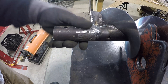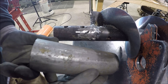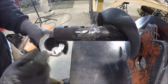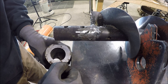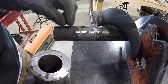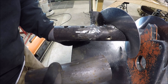I've got that paddle ground off and ground a lot of the little welds and boogers, just trying to get this thing back to halfway round. It's still a little oblong because it's been stretched. I did find this nice hunk of mystery steel — the bore is perfect. If it were one and a half inch in diameter it would fit just right, but since it's flared out it won't go on. We can bore this out to a nice slide fit, take it down so we've got about a quarter inch wall, sleeve it on, then get a paddle and weld it up. They're going to replace the auger once they get a new one in because it is bent, but they've got to get the line running.